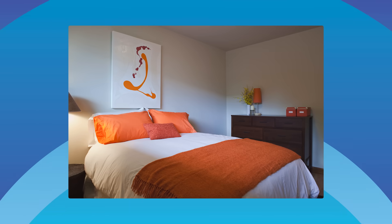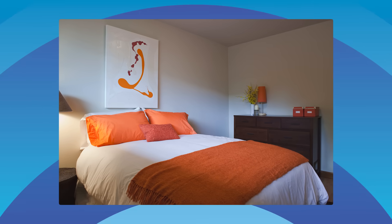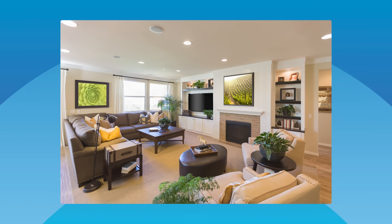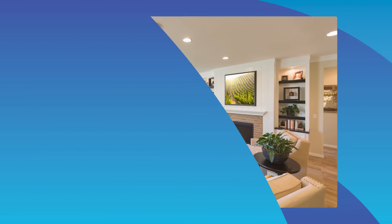For example sizing: a 12 square metre bedroom with decent insulation will be fine with a 2 kilowatt split. A 38 square metre living space with 2.7 metre ceilings and west-facing windows needs 5 to 6 kilowatts. In the tropics, you might step up to 7 kilowatts.